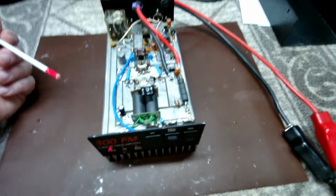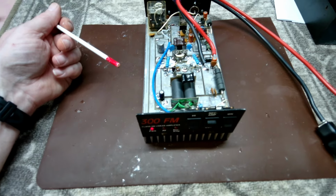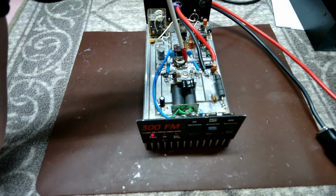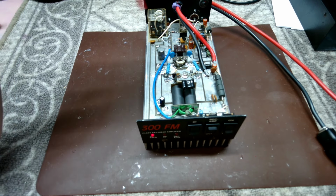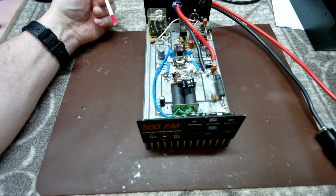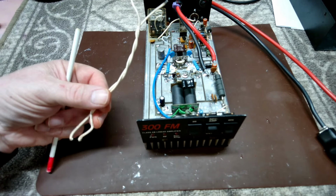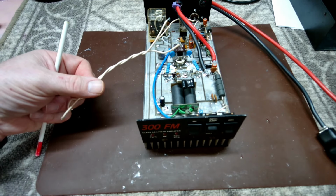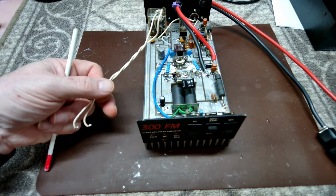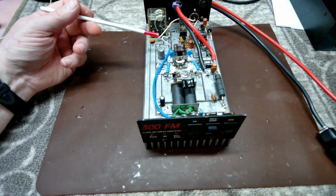And this is quite an unusual amplifier as a whole. Get the camera in here a little bit. All right, so we went ahead and pulled the originals out. We put the HG version of the 421s in there. Now, I had to make some alterations to this, part of it to get it to tune out a little bit better and get things to lay down. One of which, I replaced these two pieces of wire on the input side, which run all the way up to the front. I replaced these two wires with a piece of RG316 coax, which is this blue looking wire here.